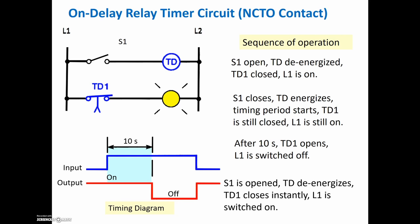There's our timing sequence. There's our switch with a delay of 10 seconds. The light is on for the entire time, but then when our accumulated value equals the preset, the contact changes state — in this case it opens, the light is off. Then when we switch that switch open again, that de-energizes the timer, this goes right back to its rest state, and the light is back on.